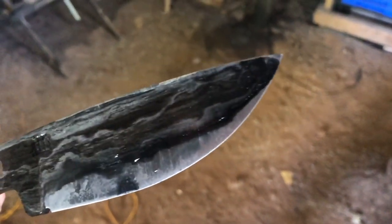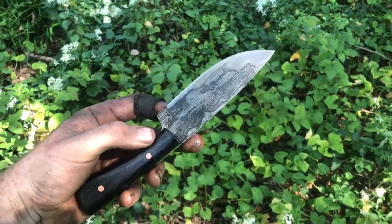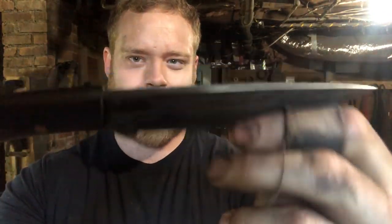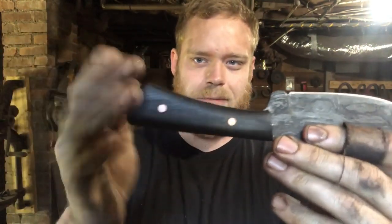After the first etching cycle, the wrought iron was running across the edge up at the tip, so I took off about a half inch of material and did some creative grinding on the bevels. Now we've got 1095 running the whole length of the edge. Kept going through the etching cycles until we got the surface finish we wanted. Really happy with the way the blade came out — the wrought iron has an almost tree-bark texture, it's really cool. Using African blackwood for the handle with simple copper pins. The knife will go up for sale on Etsy with 75% of the money donated to the Clara White Mission.